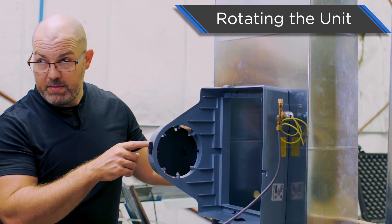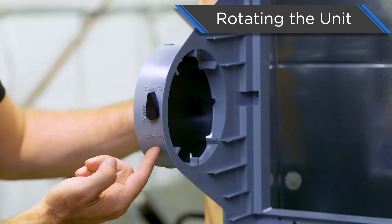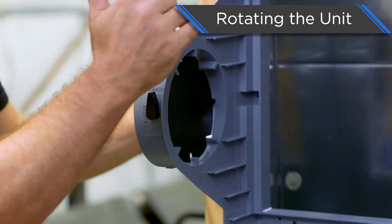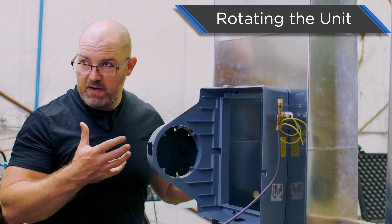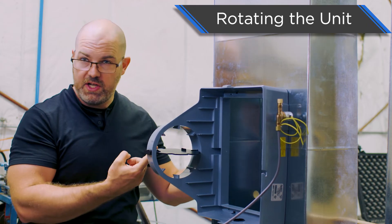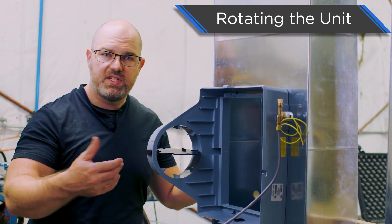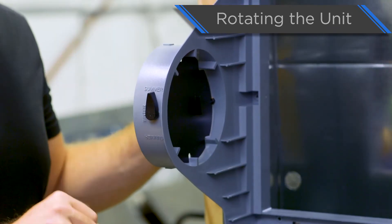Notice on the damper we have three labels: summer, winter, and summer again — with one summer upside down. This ensures that no matter which direction your humidifier is pointing, you can always see summer. When it's in summer mode, the damper is closed, keeping the humidifier from operating. If we rotate it to winter, the damper opens up — this is how we get humidity out of the humidifier to mix with the air in your system. Once the humidification season is over, rotate back to summer, damper closes, and the humidifier stops operating.